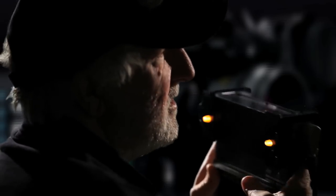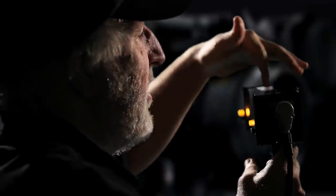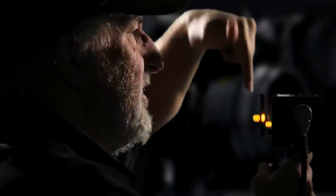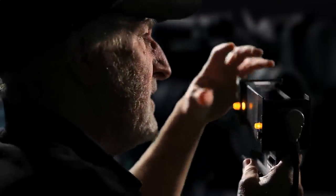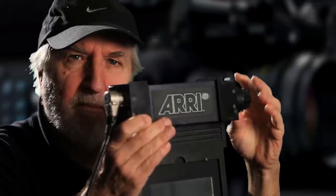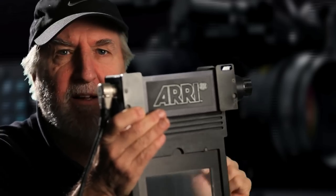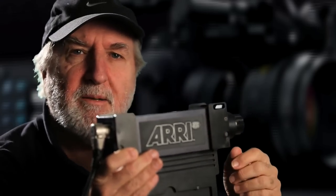So how does this unit work? In this housing on top, there is a bulb. The bulb passes light down through the unit and it passes through a shutter which is controlled by the dial on the side. What that allows you to do is vary the intensity across the filter without changing colour temperature.